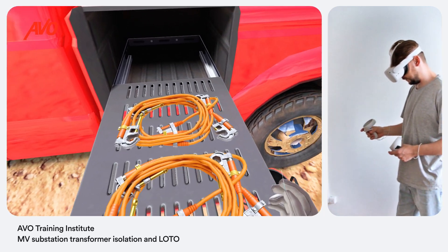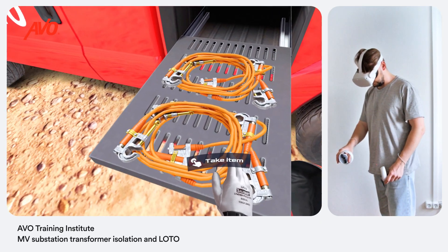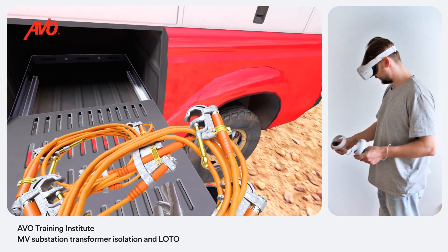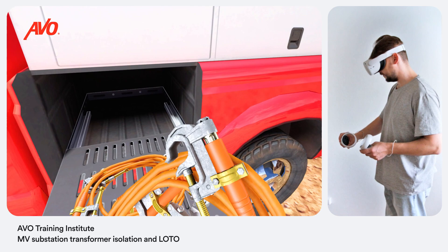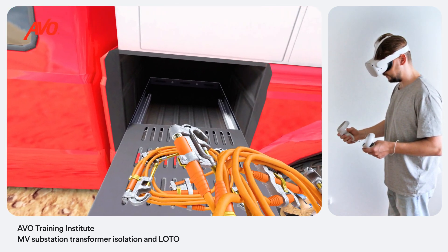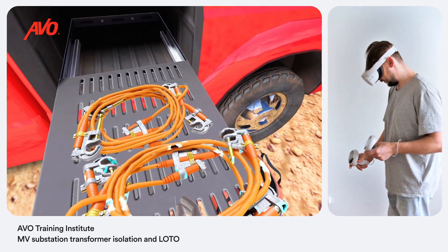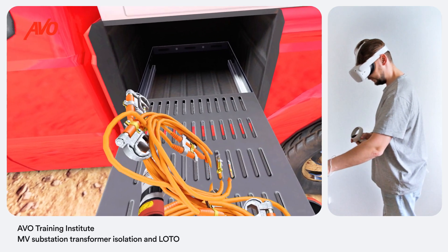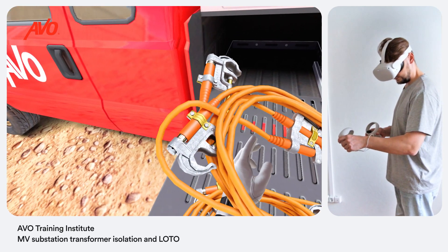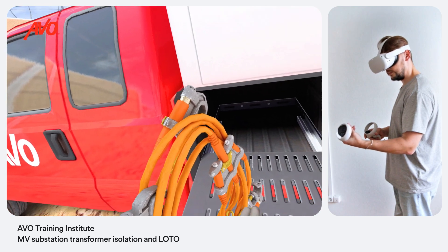You also need personal protective grounds. Personal protective grounds shall be visually and manually inspected for cracked or broken ferrules and clamps, exposed broken strands, cut, mashed, kinked or flattened cable, cable jacket damage, cracks or damage to clamps and ferrules. Check clamps for smooth operation through entire range. Check torque of pin-type terminals and jam nuts on threaded ferrules. Look for dirt, grease, oil, oxidation on current-carrying surfaces, and any other obvious conditions that would adversely affect performance. If any of these conditions are found, the PPGs shall be rejected.